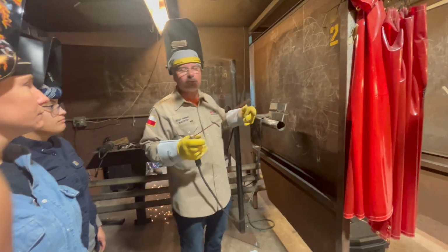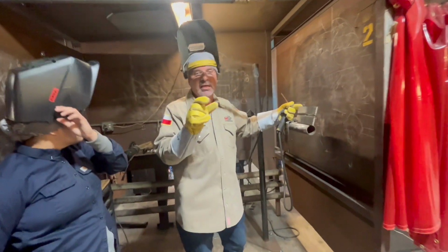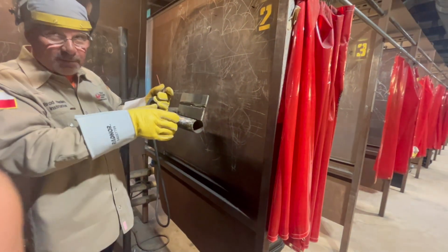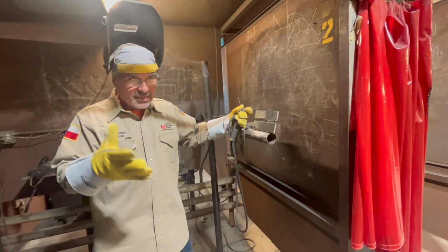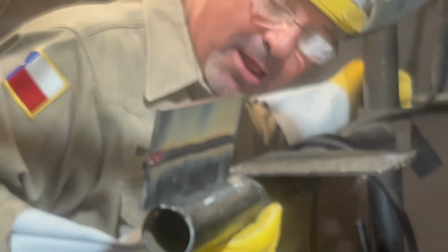I'm going to put the rest of the root in, and I should finish it out with 85 amps. That's another thing to notice. If you haven't covered at least roughly half the plate with one rod, that tells you you're moving a little slow, and you probably got heavy speed in the back, okay? This looks pretty good in the back. Overall, we got pretty good speed, okay?